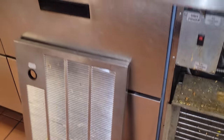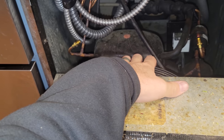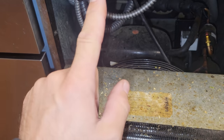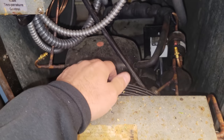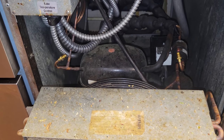I'm very familiar with how these units work. There's a hissing noise coming from up here — you can hear the expansion valve feeding. It almost sounds like it's low on charge, like there's vapor going to the valve. I'm just sliding this condensing unit out right now. What was strange was the condensing unit just shut off. It just shut off again. So it sounds like it's short cycling on low pressure at the moment.